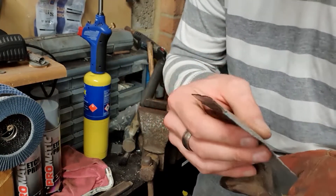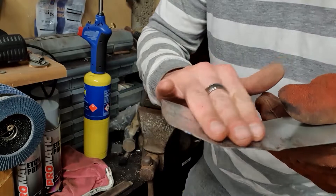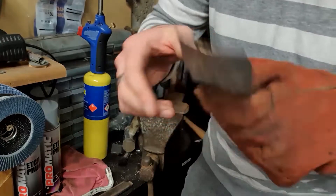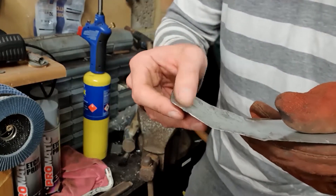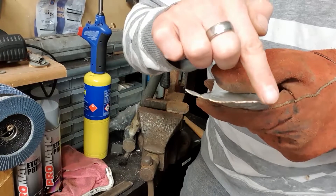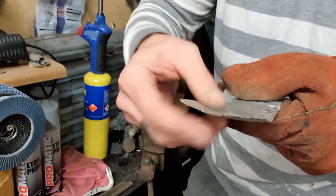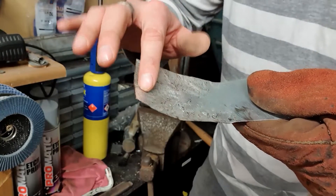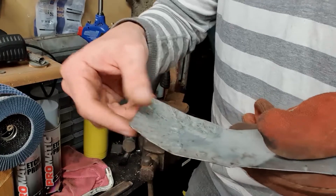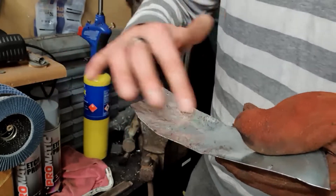Done a little bit of planishing — just starting to flatten it out. We've got the curve in one direction and a slight belly in the panel in the other. If I wanted to make that more pronounced, I'd have to shrink the metal on the sides, which will start pulling that up. The more I shrink it along this plane, the more I bring that side up — puckering the metal, making that area slightly smaller. I'm going to shrink a little bit more along both sides.